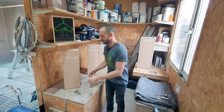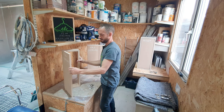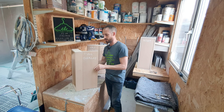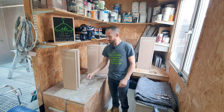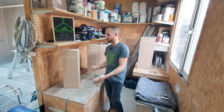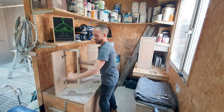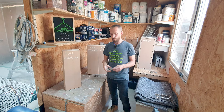These hinges open to 110 degrees, so the door doesn't open to just 90 - it goes that little bit further and doesn't hit up against the carcass. The mechanical part of the hinge acts as the stopper so it won't bind. Also, the hinges I'm using are soft close - there's a little piston inside that allows the door to close nice and softly. I always put little rubber grommets on the doors as well, so when it does close, it closes up against those nice clear rubber grommets.